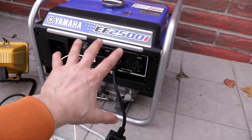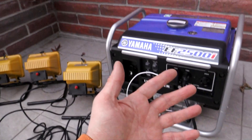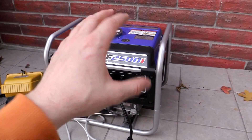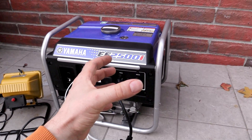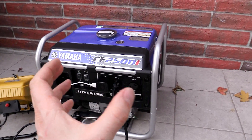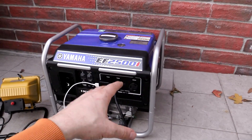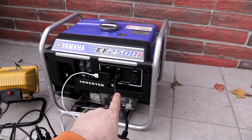That's going to turn our lights on and off and load up the generator on a one minute on, ten second off cycle. Now why do we want to do that cycle? Why can't we just run the generator with nothing plugged in? Well, that's going to cause very low pressure on your cylinder. You want high pressure on your cylinder because it's going to push those piston rings out into the bore and scrape them up and down the bore, wearing them in so they form a good seal. If you don't have that pressure, it's going to glide over the top, glaze your bores, and you're going to have a smoky engine that doesn't create much power, and you'll always be changing dirty oil.